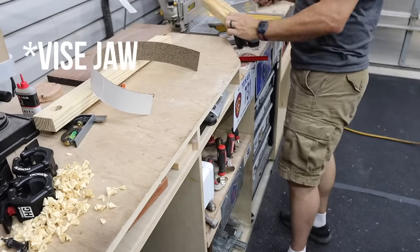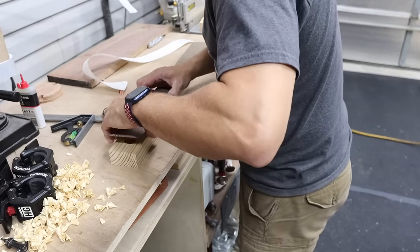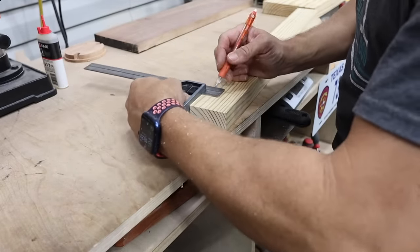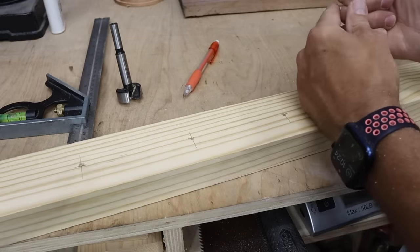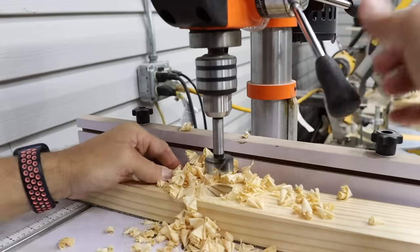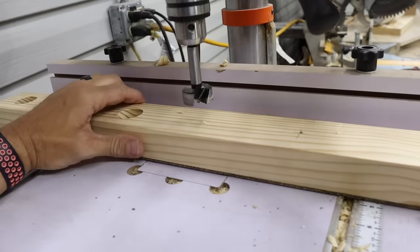Now we're gonna start working on our fence. I've already drilled one hole here before I realized I needed to put this cork on. This is some stick-on cork from Tay Tools — link in the description to all these supplies you need to build this workbench. Stick that on and trim it up to fit. Then I marked center for these holes so I could drill them out. I used my spring-loaded center punch to mark the position so the drill bit has a good starting point. I'm using the drill press and a Forstner bit. These holes need to be at least one inch — I used an inch and a quarter because that's the size Forstner bit I had, but a one-inch hole actually works better. The cork tends to stick in the bit so you're gonna need to clean that off between holes.